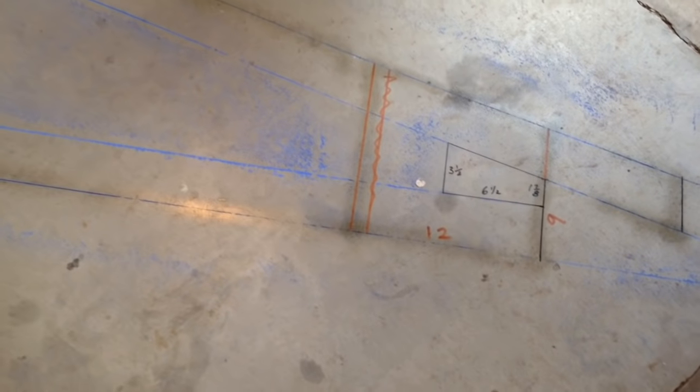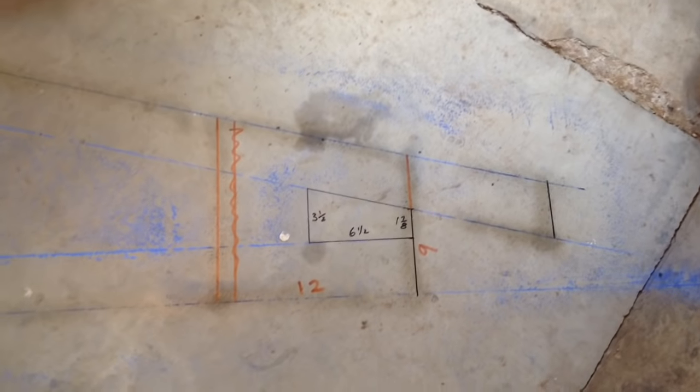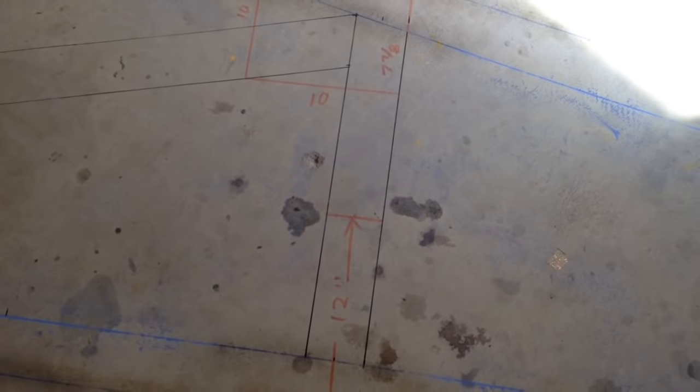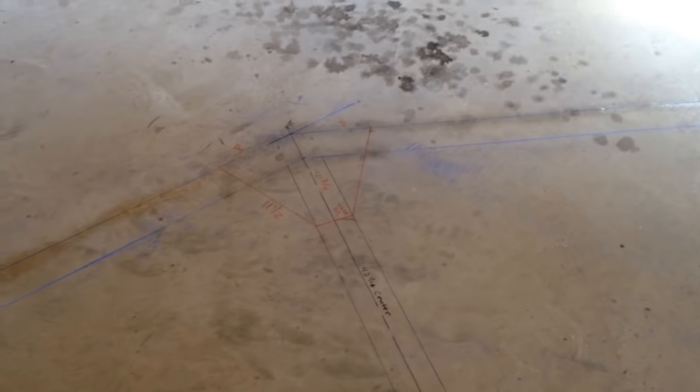The blue and the black are actually the three and a half inch two-by-four dimension width, and the orange lines you see are the plywood gussets that are going to lock these in place. When I'm all said and done, I came up with a total of 11 truss parts — bottom cord, top cord, and connecting web members — and nine gusset plates on each side, so 18 gusset plates total. Probably the biggest reason I'm doing this is that even a custom order would take six to eight weeks to get, and weather's running out, so I'm going to go ahead and fab them up myself.